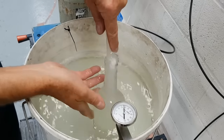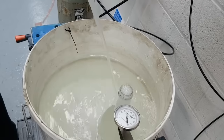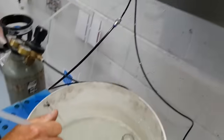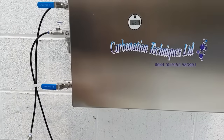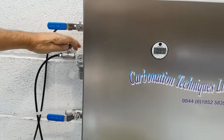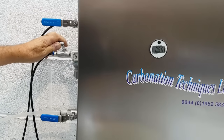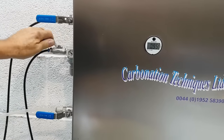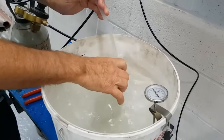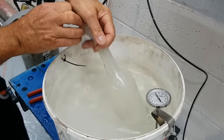This flow rate is currently just over 200 litres. We also have an overpressure pump on the carbonator which we can turn on with compressed air. We're now going to turn the overpressure pump on — this will boost the product pressure for when you're filling a keg or bottles. You can now see the flow rate has increased and the product is a bit more stable.